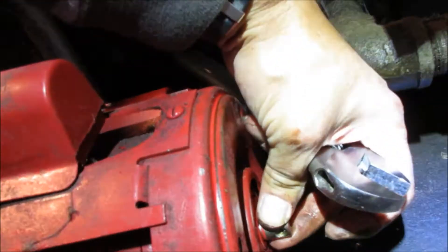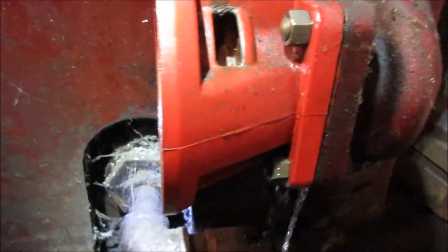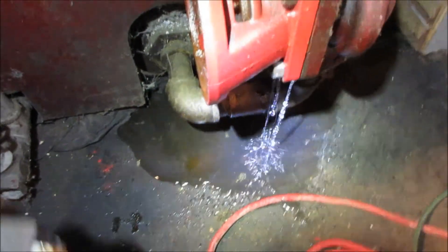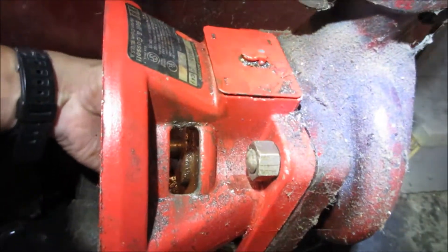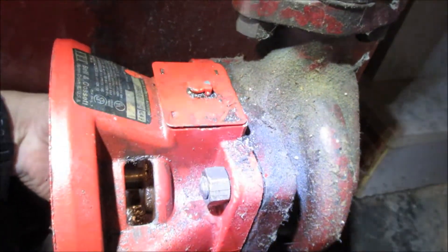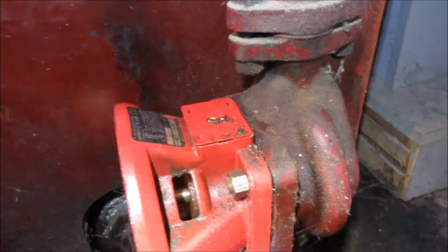What I'm noticing is the motor shaft is turning pretty freely, but this impeller right here I can barely turn. So maybe it's the impeller that's sticking. I'm going to pull this off also. I'll probably have to fill the whole system back up because all the water is coming out. I'm getting all these bolts off — I went with a 5/8 to get these big bolts off. The reason I'm taking these off is because this thing didn't spin freely. There it comes.